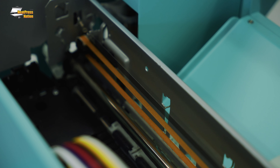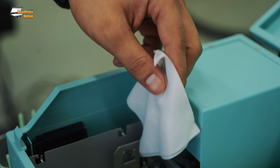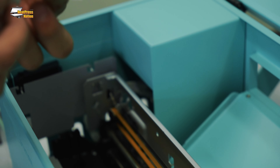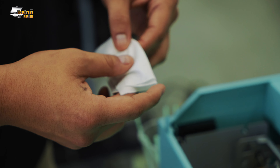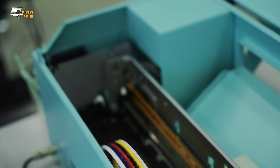Next, we're going to go ahead and do the weekly maintenance. Weekly and as needed, we do need to clean this encoder strip, which is this clear strip right here. Make sure you are using a lint-free wipe. We're going to carefully cover it and just slide across it very gently. This machine is pretty clean, but again, it is weekly or as needed — we're going to clean this encoder strip very gently.